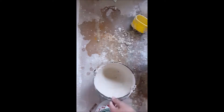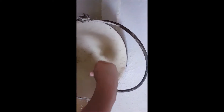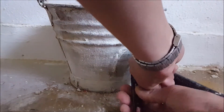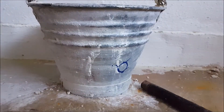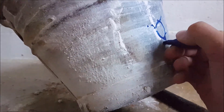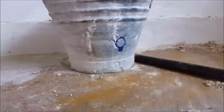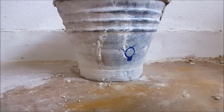We just let the plaster sit for around 5 minutes. After that, we are going to need to drill the hole for the pipe. Remember that we need to make the hole angular, at around 30 degrees to one side — it doesn't matter if it is clockwise or anticlockwise. I also made a small hole so that if there is a crucible failure, I can still pour the aluminum out.